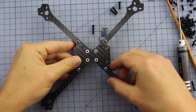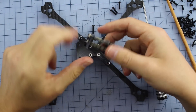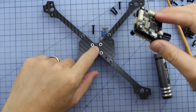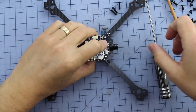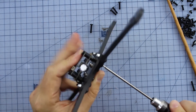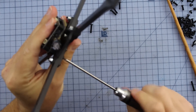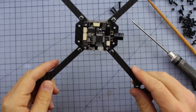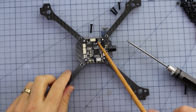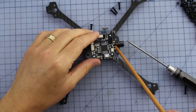Now we're going to attach our stack. It doesn't matter which side is front or back initially. You'll notice four little standoffs underneath our ESCs — they simply go onto those middle screws we've run all the way through. Everything else is tightened down, and these parts should pull straight into your frame. Sit that on top, flip it over, and screw it down — it should come nice and flat. Whichever way the arrow is facing, that's where the front of the drone is going to be. Where the capacitor is and where we attach our battery lead, that's the back.